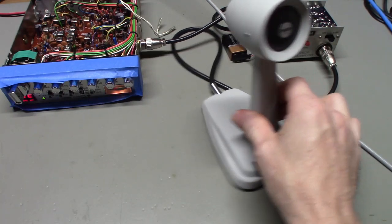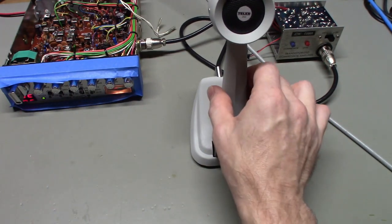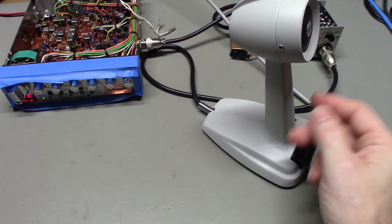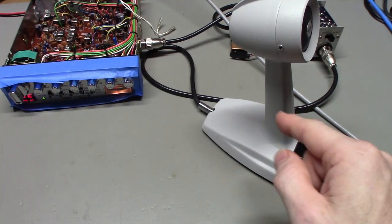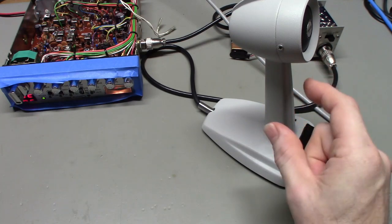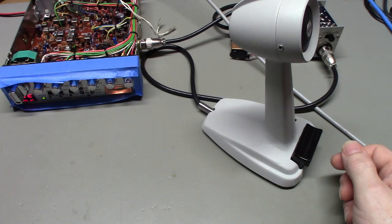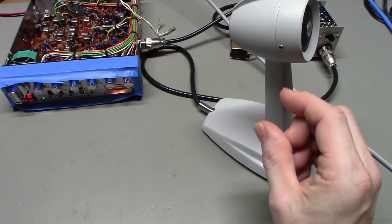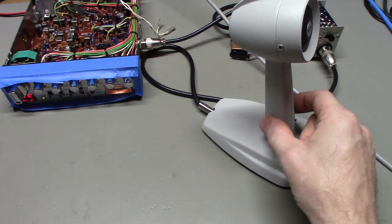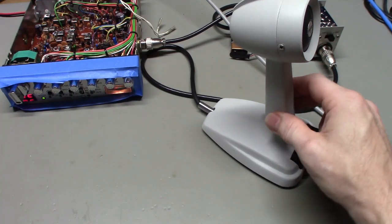So without having to spend an hour or more playing around trying to make up a battery compartment, what I used was a BR 2/3 C, so a 2/3 C battery. It's a 3-volt lithium battery. You'll see those in a lot of test equipment. They're like memory backup batteries, but they're about that big around and about that long, and it's the right size that it'll fit inside the neck of this microphone body, because that's the problem.